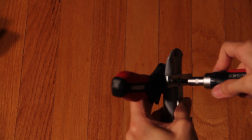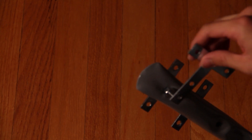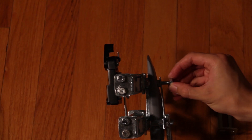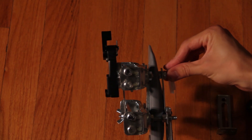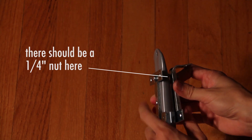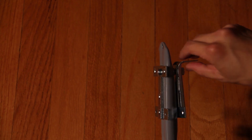A warning: don't try to over-tighten things. If they're hand-tight or finger-tight, that should be good enough, because these are metal parts that are not incredibly thick and over-tightening can cause them to warp. Next, take a third T-plate and screw the base of it onto that same one and a half inch quarter-inch diameter screw. Add a nut to that same screw above the T-plate, then add a plastic insert that comes with the bifold door bracket — make sure the flat side faces the jumbo arm hook — and thread that on. Secure everything with another quarter-inch nut, but at this point don't fasten it too tight; you want to leave the bracket room to move because you'll want to adjust it later.